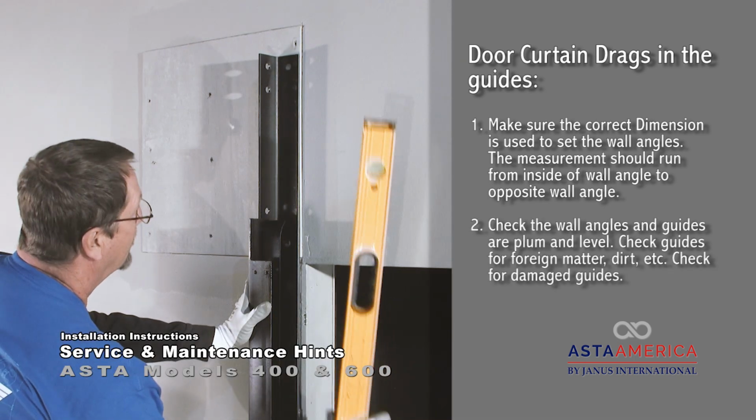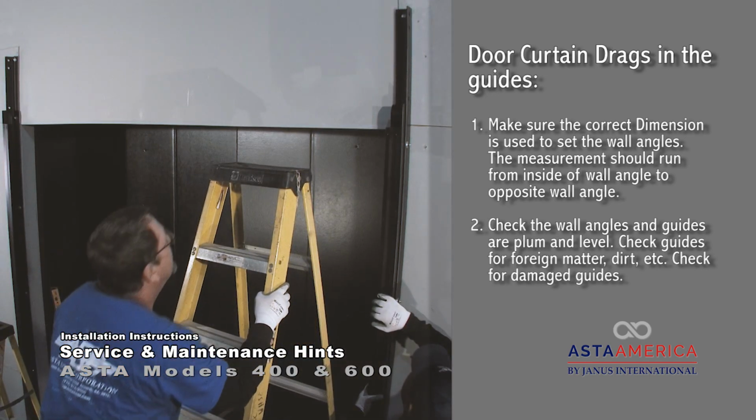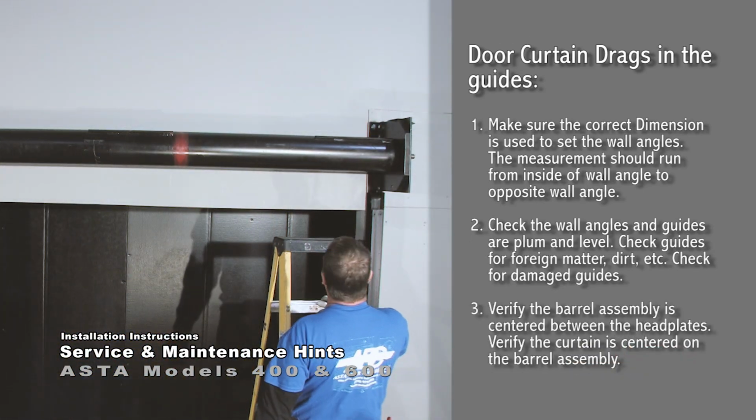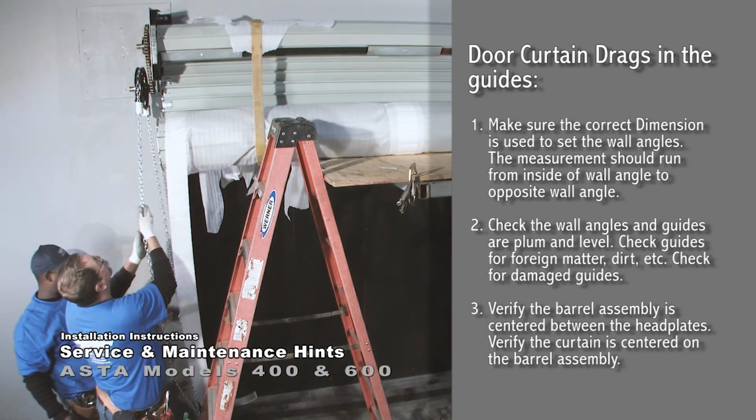Check the wall angles and guides are plumb and level. Check guides for foreign matter, dirt, etc. Check for damaged guides. Check to verify the barrel assembly is centered between the head plates. Check to verify the curtain is centered on the barrel assembly.